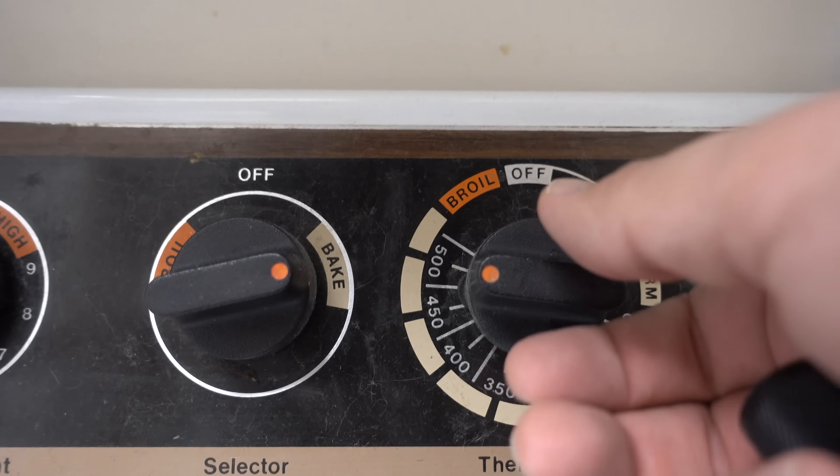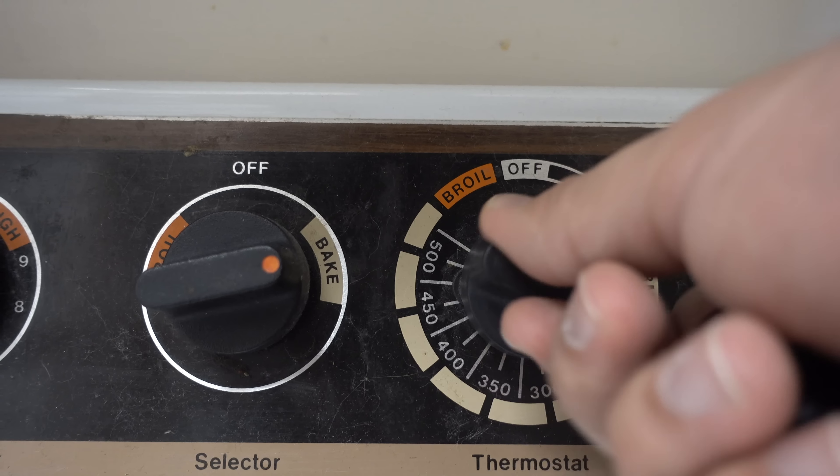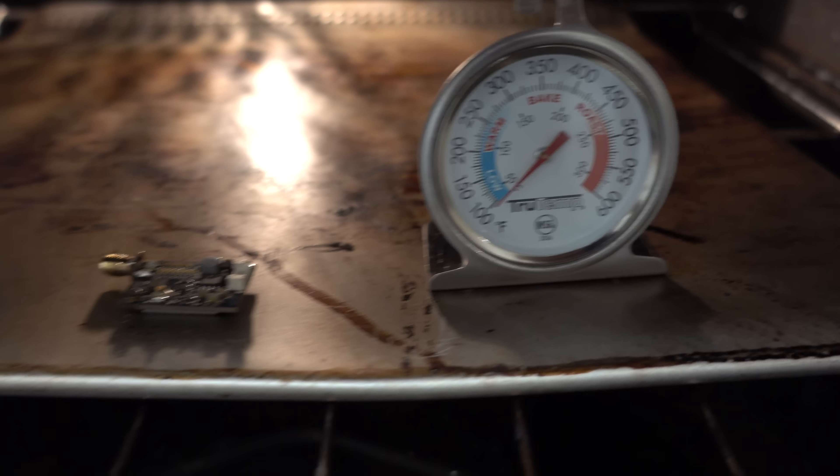The oven temp has reached 450 degrees on the inside and we are turning it off. The oven reached the target temp of 450 — we've turned it off. Now we're just waiting on everything to cool down. Until it gets below at least 370 degrees Fahrenheit — that's the melting temp for solder — but really we're going to aim until it's 100 or less, because that's a temperature I can easily handle it at.